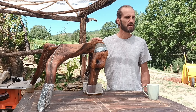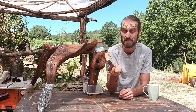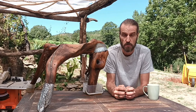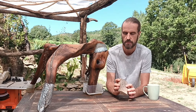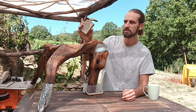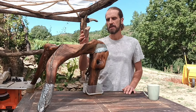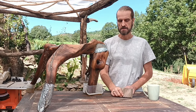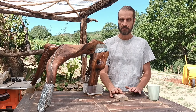If you ever wondered how you get a very soft, almost velvety feel of the wood surface — that is easier to achieve if you have a sponge sander. It's basically a normal sponge like we have in the kitchen, but with sandpaper on it. Instead of adding scratches like regular hand sanding, the spongy surface eliminates the scratches and makes the surface super smooth. This is the last stage of sanding to get the final finish.